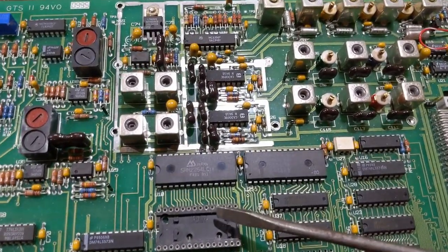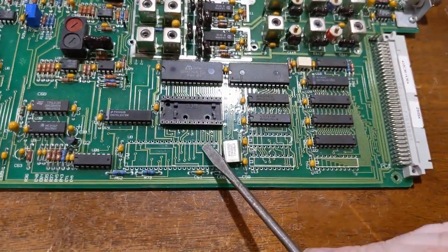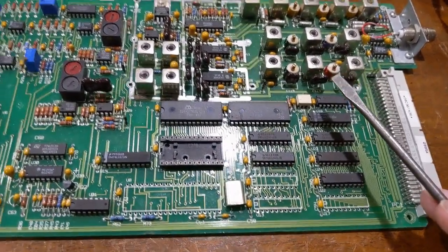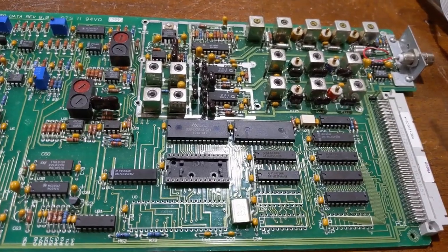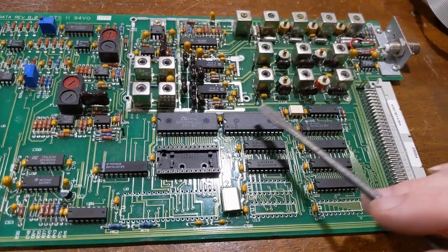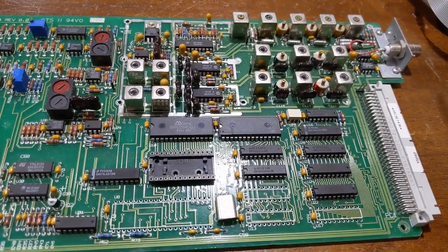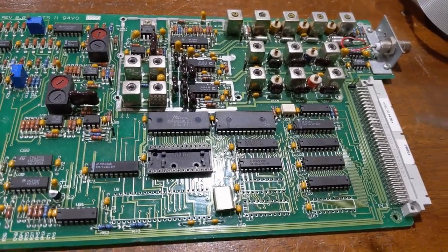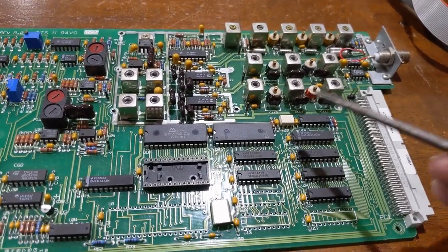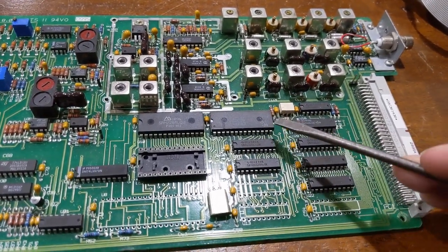And this was the ROM that this chip used to boot. And of course, the way it works is there's a FIFO, because this chip could be downloading data bits from a stream at whatever symbol rate. There could be interruptions in the satellite data stream. There could be whatever else. And that gets spooled up into this FIFO. This FIFO stacks up the frame. And once the frame is complete, this will send an interrupt out to the CPU that tells the processor program, hey, we've got an impending frame ready for us to review. So then the 68K CPU will come back and it will read this memory out, which contains the packet that just got decoded over the satellite feed.